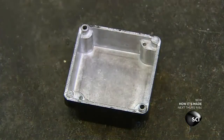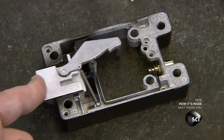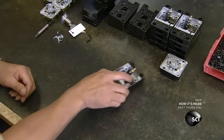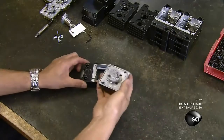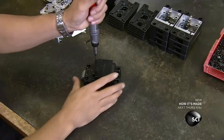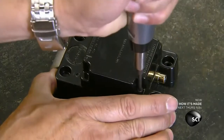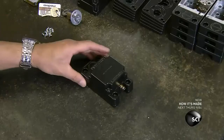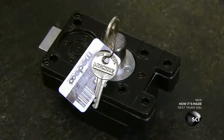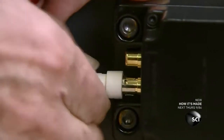Once the timer is accurate, they screw it into the timer cover. The lock body contains the lever that retracts the lock's latch, and also has a brass electrical plug to connect a time delay indicator light. After securing the latch and lever in position with the cover plate, they install the timer assembly. The visible side is painted black, just like the visible side of the cover plate. Then they insert the cylinder assembly, mount the lock on the door of the safe, and hook up the indicator lights, which run on AA batteries.